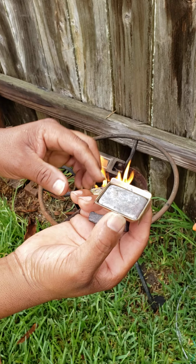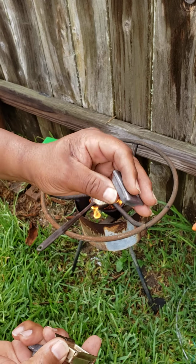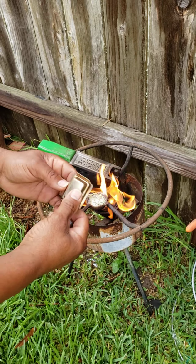Kind of thought about it. I figured this was a teaching moment. I used to walk the neighborhood at a Firestone where I used to live and pick up these tire weights, melt them down over the fire here, melt them and make lead ingots. Just pour off under the slag, come out with some pretty pure lead right there.